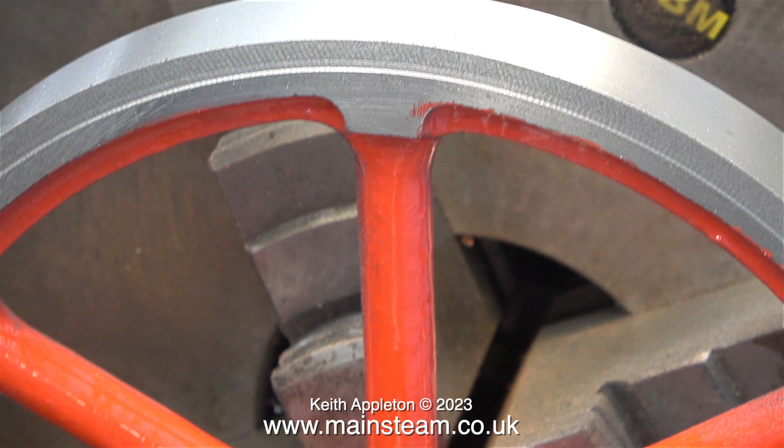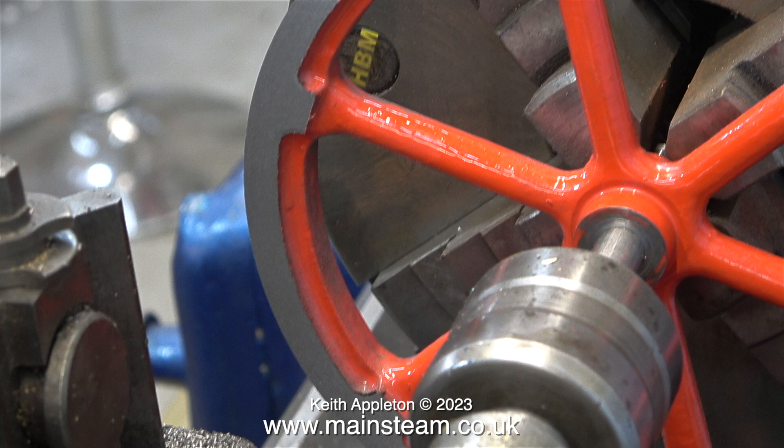This is the other side of the flywheel, and once again I used the cutting tool that wasn't right, the speed wasn't right, and the feed wasn't right — and that's why this side of the flywheel looks the way it does. And that is it for this episode; more fun with chattering in the next one.